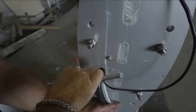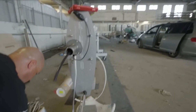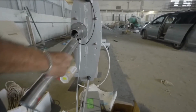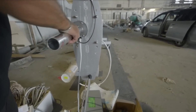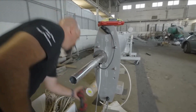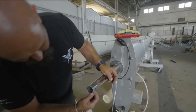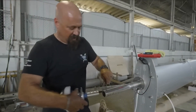The lightning prevention system is actually fairly simple. We're going to drill and tap some holes in the top of the mast, then install a stainless steel base plate that bolts to the head of the mast. From there, we will attach an extension rod that allows us to elevate the device up above anything metallic on the mast.